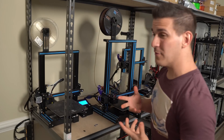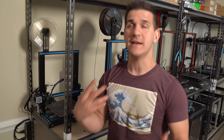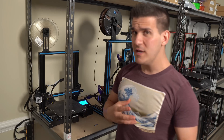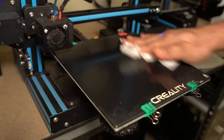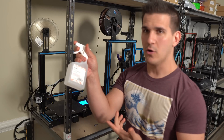I level my 3D printers once every couple of months, if that, or if I have some big catastrophic failure which requires me to take apart the printer. Starting up these two Ender 3s, I'm going to start preheating them, and as I'm preheating them, that's when I'm going to clean the beds. I don't do this before every print — maybe once every other week or so — but I'm using 91% isopropyl alcohol, spritzing the bed with it, wiping all the gunk off, and making sure it's nice and clean. This guarantees a very good level of adhesion. I've been doing this for like two years and I've never had any issue with it stripping the coating or needing to replace my beds.